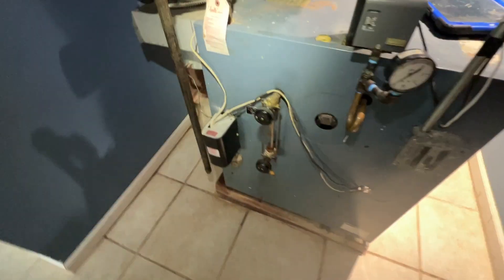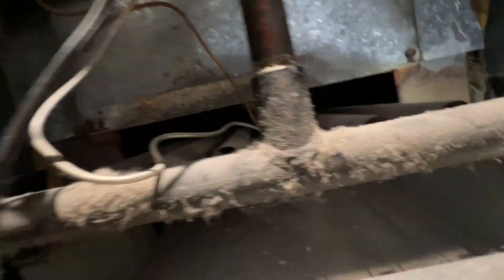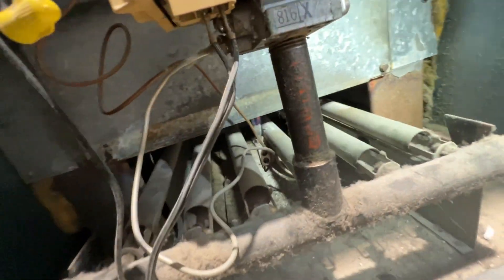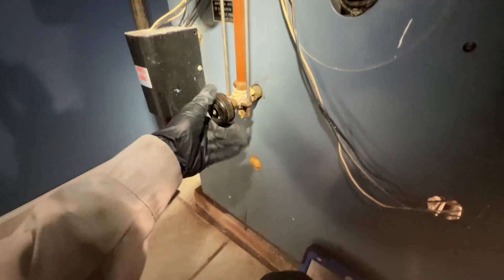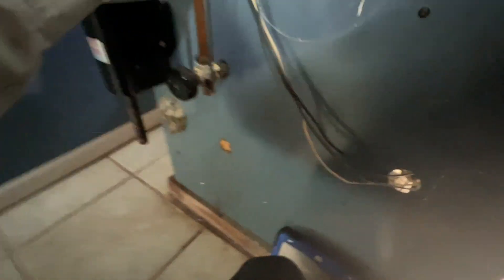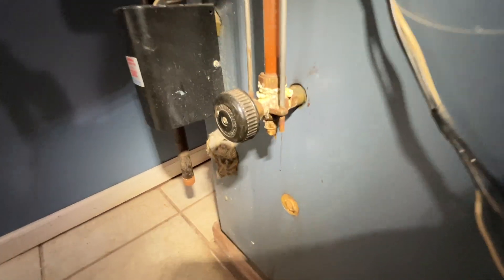I will fill the boiler to the fill line to make sure that our heat exchanger is not leaking. I'll check that from inside. Filled up to the top and I'll let it sit like that, make sure we don't get any water drips down in the combustion chamber. You can see our pilot's lit, which is a good thing. I'm gonna close these off, grab nuts and washers, and the gaskets, and we can replace those and get rid of all this crusty corrosion.